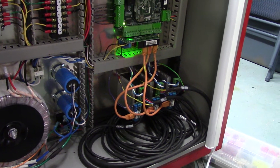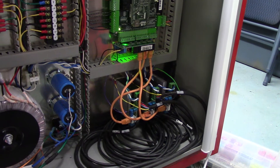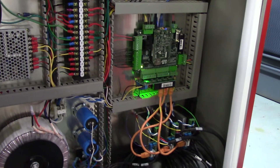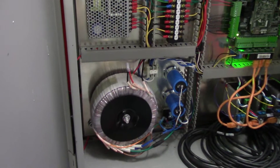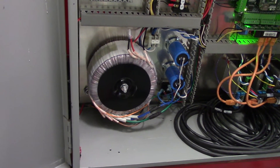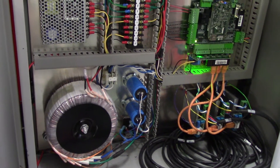The CNC4PC boards mount to the DYN2s using their little ethernet cable jumpers — that seems to be working well. There's the toroidal power supply that I built. I bought the toroidal transformer and then had the capacitors large enough and the bridge rectifier large enough to do this project.